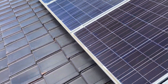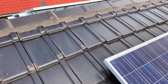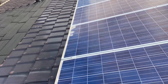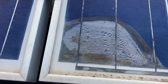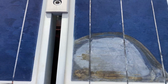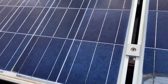Funny enough, one of the inverters is working at the moment — they're both little 1.5s. If you have a look over here, you can see it's even worse. Water-cooled solar panels, viewers — who would have thought? So that's literally tracking to the frame and giving us our ground fault and shutting the system down.